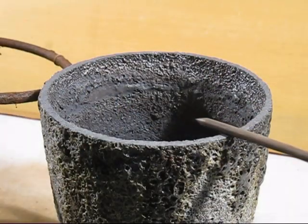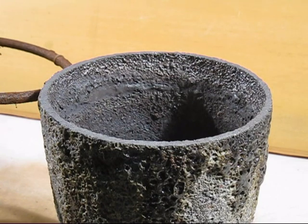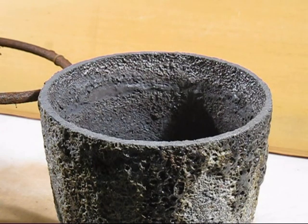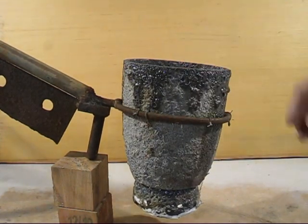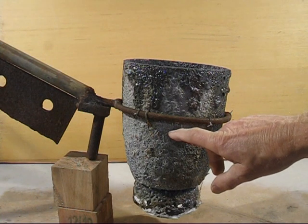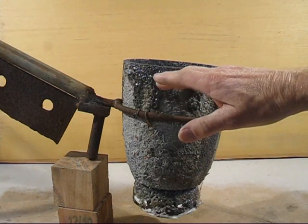This is what the lip of the crucible looks like now. It's been reduced in height a little bit but that should last for at least another five melts and then it'll probably start deteriorating again. When this crucible has reached that point, I will thoroughly clean the inside out and then use it for aluminium. Right, putting the crucible in there — you can see the wire is holding it up, but I might have to use a heavier gauge wire so the crucible sits slightly higher.